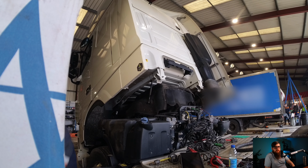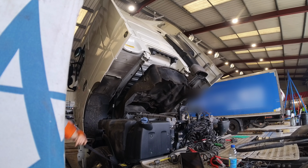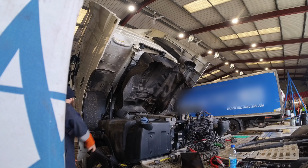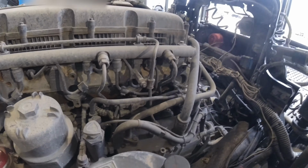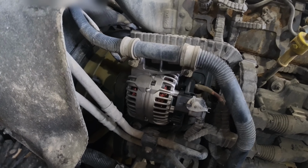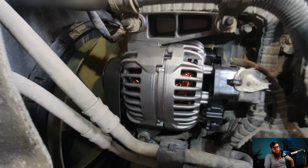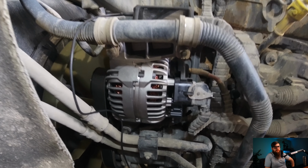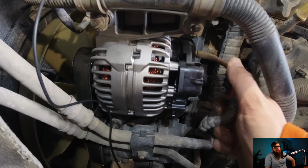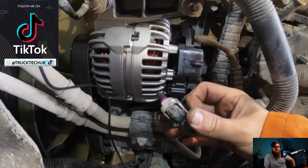I'd better throw the cab over as this LIN system we need to access is generated from the chassis module front to the alternator. A new alternator. The less informed first go-to component to change. You can't beat throwing 600 quid worth of alternator at a truck because it won't charge. Well done to whichever technician changed this, making a good name for our industry here. So with that out the way, let's look at our LIN fault and see what's going on.